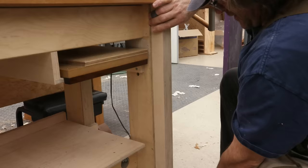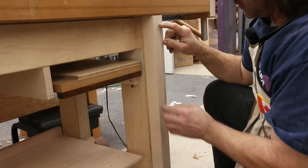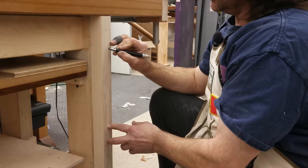Now we'll set that right there. All it's going to need is just one screw here and one screw there, and we need to drill our holes. I figure our spacing should be — maybe we'll start with one right about here, and for the first foot or so we'll do them every two inches, and then we'll maybe go to three inches the rest of the way down.